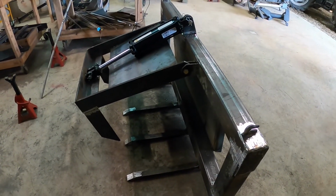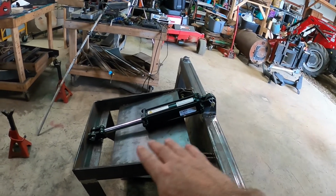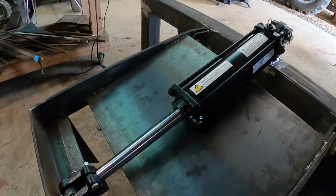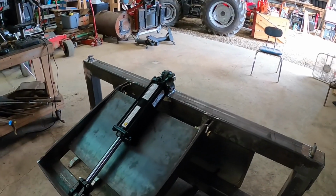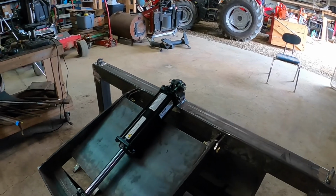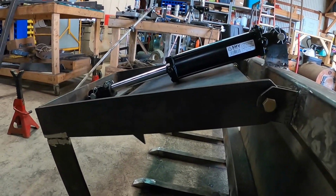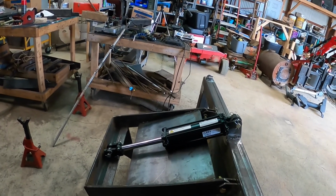Didn't videotape everything, but I've got my steel plate as protection there and as protection on the grill when this comes up. Oh, okay, I can't do it because I've already closed off the hydraulic cylinder, but when it's standing up, it does protect fairly well. And it protects the cylinder for the most part when it's closed. I do still have clearance. It's pretty tight tolerances there, but I made sure it worked.